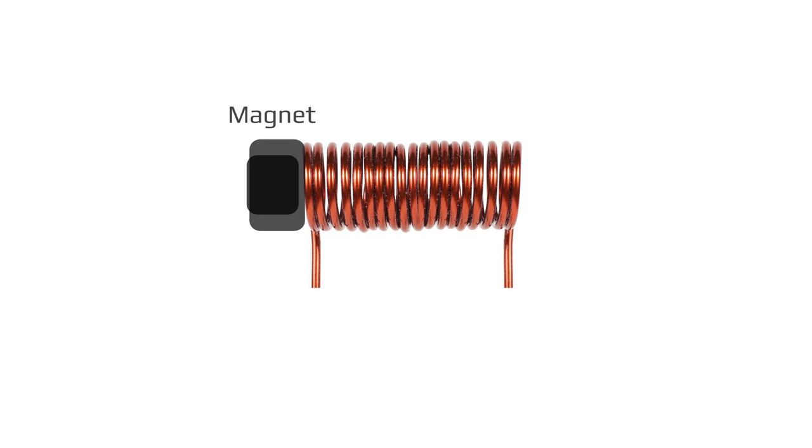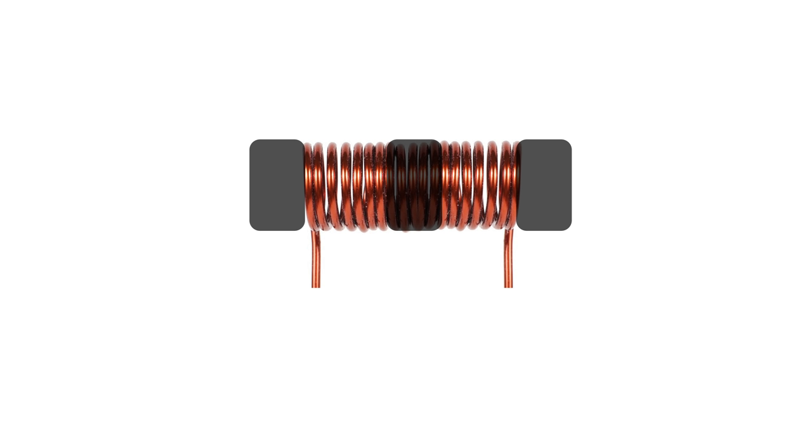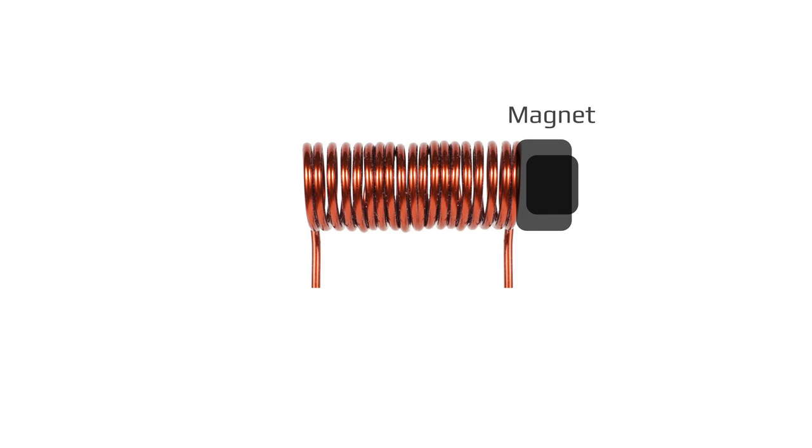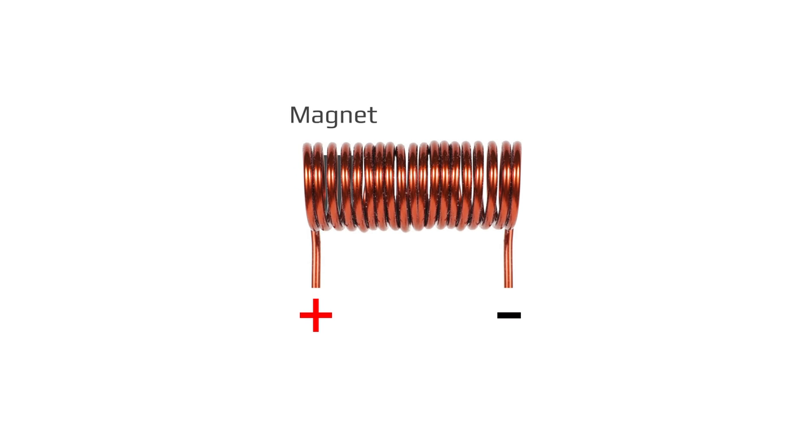The dead zones are the end locations where the magnet would end up moving to, assuming it were unconstrained. When the magnet is in one of these zones, it is being held in place by that coil. We never want this to happen while the engine is running. We want the magnet to always be pushed or pulled. So whenever the magnet is near a dead zone, the coil is turned off.